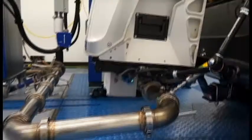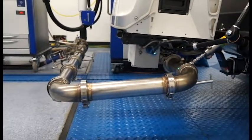We also have our exhaust flow meter underneath the device, all mounted together to give you your mass emissions on road. We have a central data acquisition system called our system controller that has software that then controls whatever devices we have on the vehicle in use. It will take control of those devices and bring them all into one file. We have our GPS data as well as our weather data that's all collected. We also have the ability to add an additional gas analyzer in the form of a dual channel FID, measuring total hydrocarbon as well as methane. We also have the ability to do particle number on the vehicle as well as particle mass on vehicle. We have the ability to do real-time fuel consumption as well.